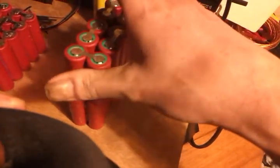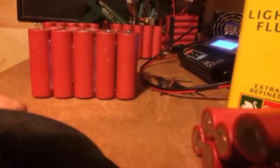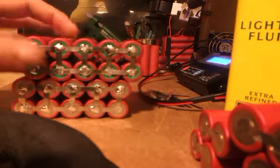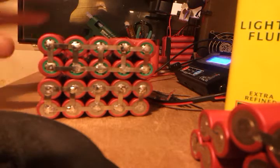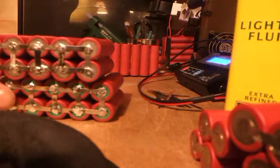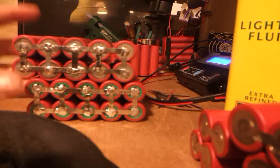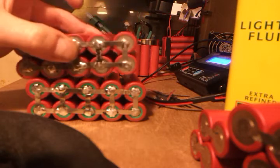So to fold it back up it'd be like this. Let me show you the ones I've done so you can have a look at what I was talking about. These have been paralleled up but they've not been fixed in series yet. I did do the other end, so yeah they're totally done — I could series those up now. It's a good idea to put a little bit of charge in each one of these blocks before you series them up.